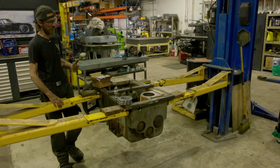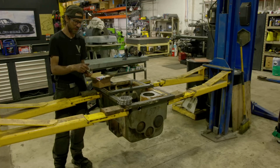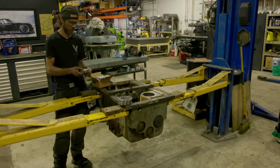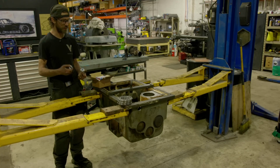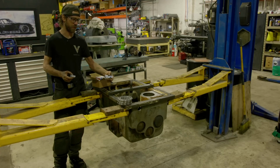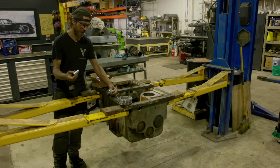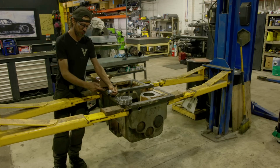And in terms of the actual draining, Josh Topper reached out to me and advised that I grab a couple of these and make my drain plugs out of these hydraulic fittings. That's what he has on his lathe. This is a great idea. I bought these. I was intending to use them. We can mount this basically to the gearbox, have a hose, plug it in, and it drains, and then when you unplug it, it seals.